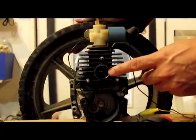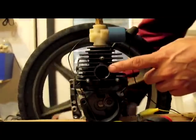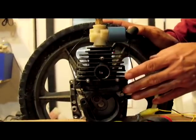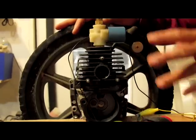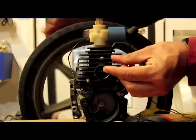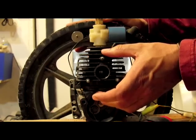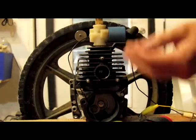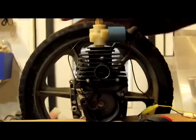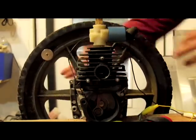As the air comes in, it's only in there for about a quarter of the stroke, and then the air is instantly exhausted through here, and as the piston comes up it resets, and we hit it with air again. So we're not filling the entire chamber with air like some steam engines do. What happens is you're only putting high-compressed air into a really small space. In a regular steam engine, as that stroke gets longer, the air volume inside that piston doubles and quadruples with each lengthening of the stroke, which requires a lot more steam to produce basically a single stroke. While that does produce more power, it doesn't necessarily produce more power relative to efficiency over an entire run.